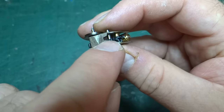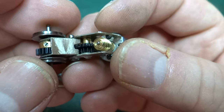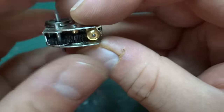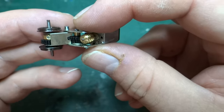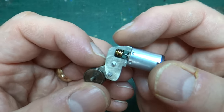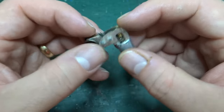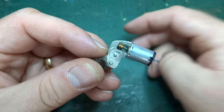We also talked about the fact that we have to notch this part so that it would clear the gear - you can see there it clears this gear when it's in place. I also had to reduce the length of this side of the part - they're no longer equal length. That's because there's a washer in here and once I spin this up, it was jamming on the washer, which wasn't far enough up, so I've rotated it around. When I started to put it into the frames, the very rounded tops - this top essentially came straight out and then round the corner - and I've cut that triangle off on both sides. That means that when the motor's rotated all the way forward, this top is now almost flat so there's nothing sticking further up that would interfere with the body.